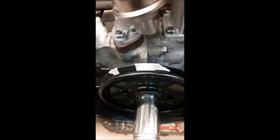You can see I already moved that. As we come up, you'll see the piston stop again right there. I've already made my little pencil mark exactly where the piston stops — not TDC, but where the piston stops. Now I'll rotate the crank the other direction until I find the exact same spot with the piston coming up on the other stroke.